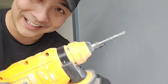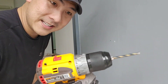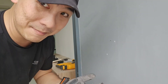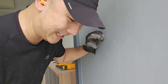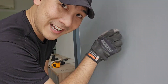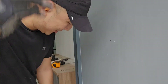And a drill like this — this is a rotary hammer drill. If you go with something like this, it's just a drill with no impact. You can go with a hammer drill, but it's reinforced concrete and you're going to have a hard time. Once you have your holes marked out, you want to go through a detector to make sure there are no hidden wires or piping behind there — because if you puncture a pipe, it's not a good thing.